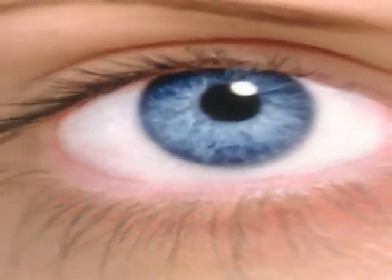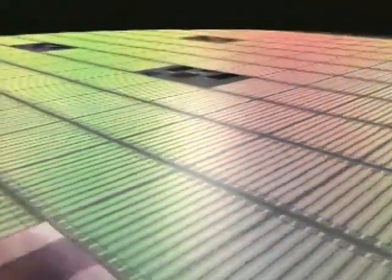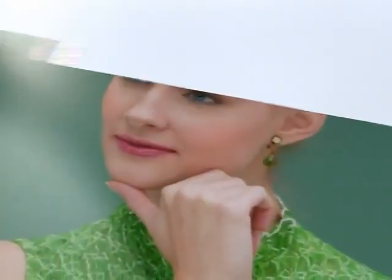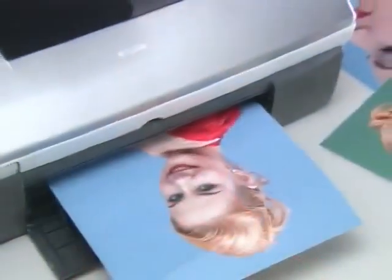What's more, each nozzle in this printhead ejects microfine ink droplets at the high speed of 24,000 per second. This ultra-high performance printhead also ensures placement of ink droplets with ultra-high precision. We brought together our high-level materials and semiconductor production technologies to realize this ultra-high performance printhead. Original technologies from Canon continue to advance the image quality and output speed of Bubble Jet printers.